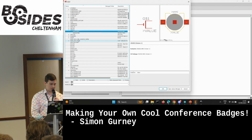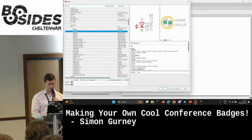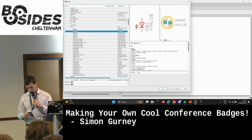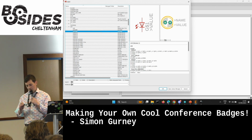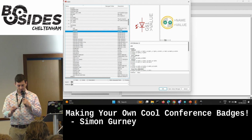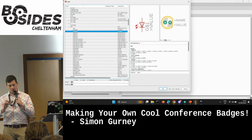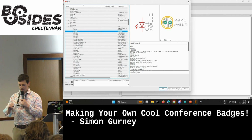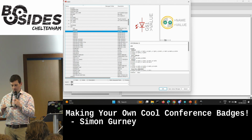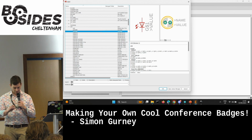And then we're going to get some LEDs. And we'll go for these. So these are through-hole LEDs. So all the stuff you see on the board today is surface mount. Well, not on your boards unless you're a volunteer or a speaker, or you bought a kit and you want some pain later on. All of them are surface mount, and most of them are mounted the wrong way because they're not designed for PCB art to shine through the PCB. They're designed to face upwards. So what you end up with is these solder ramps and things on the back.